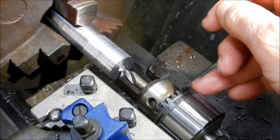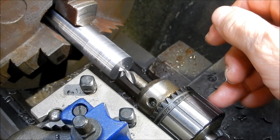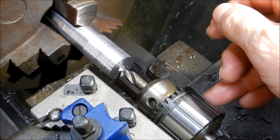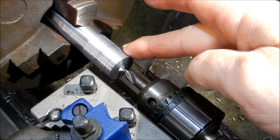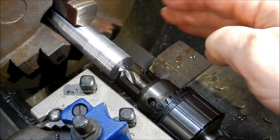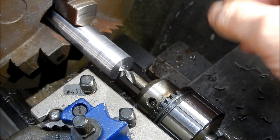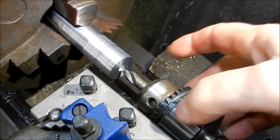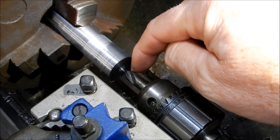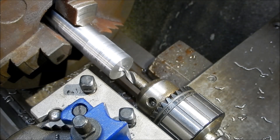It's funny because I was looking at Adam Booth's latest video a couple of days ago and he actually shows this exact same technique. This is a technique I learned off the leading hand in the workshop I was at — a big German called Adolf Loges, six foot seven, huge man. We used to get a lot of polyurethane coated rolls coming into the workshop as part of the aluminum processing equipment, and often the ends would get knocked around and the centers were out. So we'd set up a fixed steady and remachine the centers. This technique puts a little bit of pressure on the chuck just to keep it off to one side — it was important to have the cutting edge leading to be able to do that cutting.